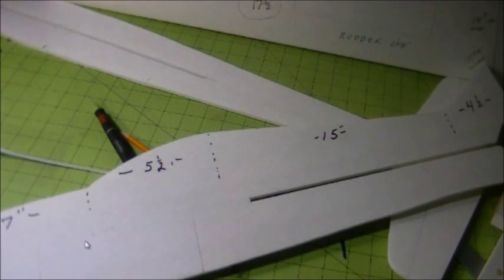and I decided to make it a little easier, so I just put it together in a scissors cut. In other words, I just cut it down the center like that and assembled it just by sliding the pieces together. Now, you can see it just slides together. The difficulty here is that, of course, you have to have it straight. It's going to want to wander a little bit, so you have to mark it real well. But that was basically how I did it.